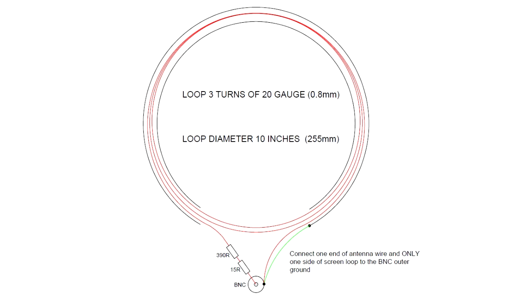So the description that I have just given you is what they call a standard loop antenna, and you'll find that widely described of how to build it in lots of various radio service manuals and literature. But when I was thinking of constructing this loop, it presented me with a couple of problems. One is I don't have any suitable brass or copper tubing. And one thing is, when I make something, I want to make it nice. So I think it would be quite difficult to actually bend that copper or brass tubing into a really nice C shape.